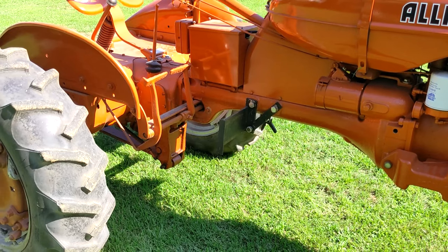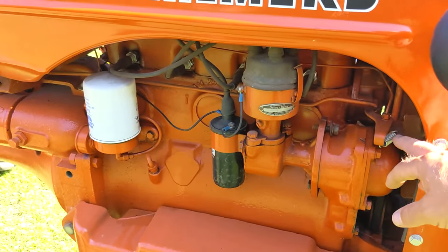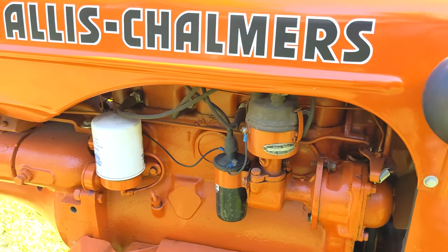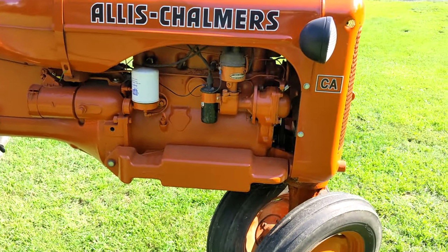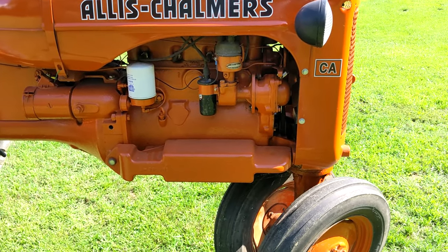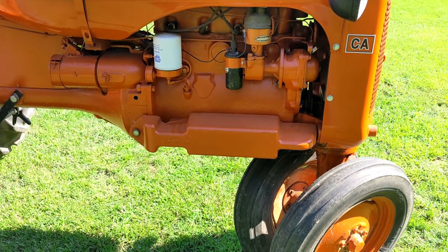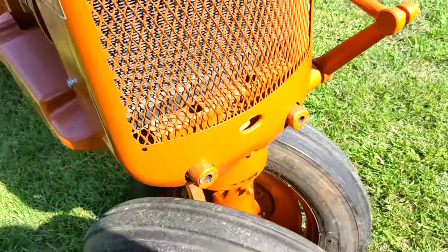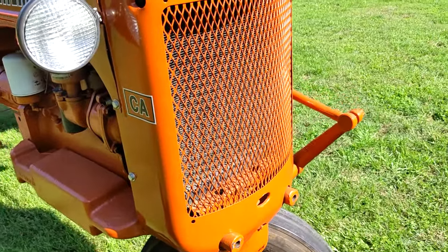It's got plenty of power and a pretty low first gear. On this one, I have swapped out the governor spring for a stiffer one, which gives me much more RPMs — I'm probably in the upper 20s, maybe even 30 horsepower with this tractor. The motor is real easy to rebuild on these — it's a wet sleeve design, and the engine clutch is easy to get to. Up front, you have the mounts for the cultivator hookups. You could have a hand crank if you didn't have electric start, in which case you'd need a magneto.